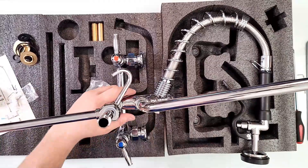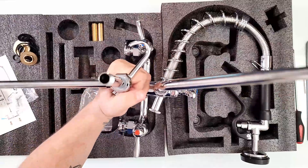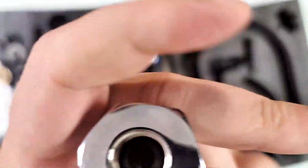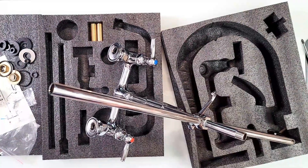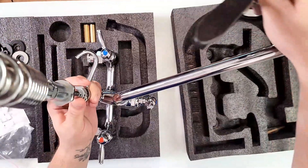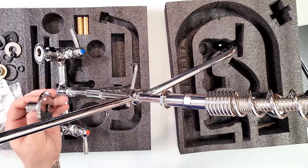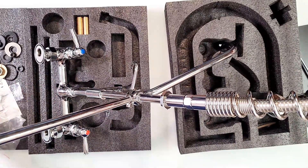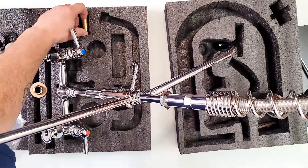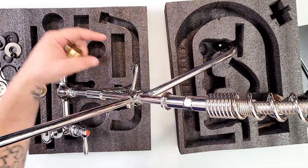The sprayer goes right here — it has a pre-installed rubber inside. Put it right here and boom — it is pretty much installed. Just put the wall plate so it holds. The rest — you have the two sides here that go through the splash plate on the back of the sink, whether it's attached or detached.